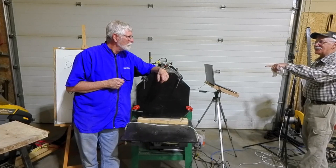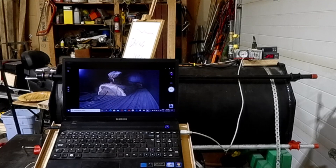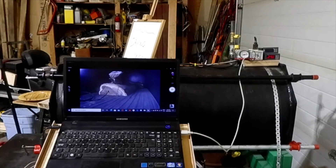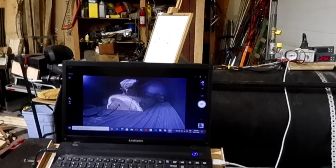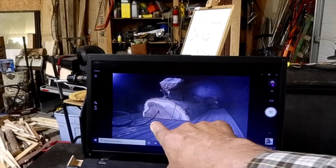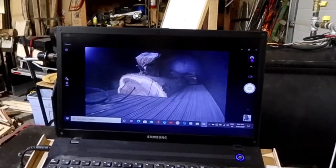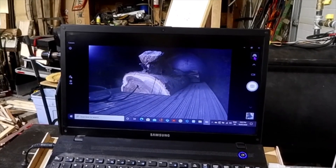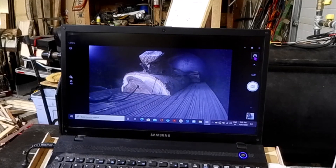We put one of Bert's cameras inside. What you see is the end of a piece of mountain ash — it was green, about 42% moisture just below the hole where I drilled out a quarter-inch hole and stuffed in that little sensor. We see some whispering action as the vacuum is being pulled — we've pulled about six or eight inches of mercury so far. I'd never bothered with a camera before because I didn't think you'd see much, and it doesn't matter to the drying process anyway.